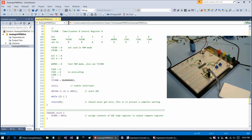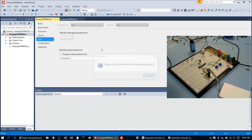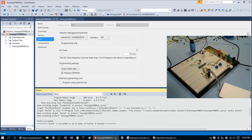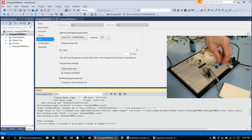Let's go ahead and run the program first as a proof of concept with Control+F5. It's going to tell us to pick a programmer. We select Atmel ICE, ISP, then Control+F5 again. If we turn the lower potentiometer all the way up, the LED is now full bright. If we turn it about halfway, the LED is half bright. As you can see, turning it up and down controls the brightness — that's working pretty well for us.